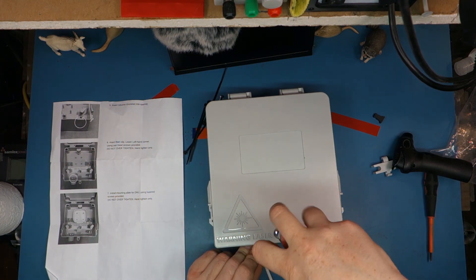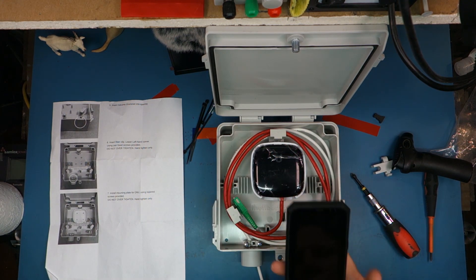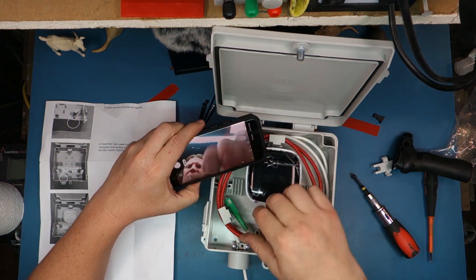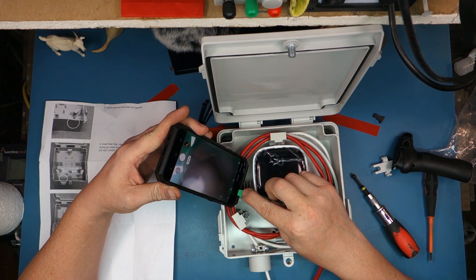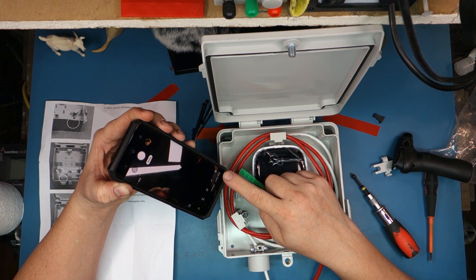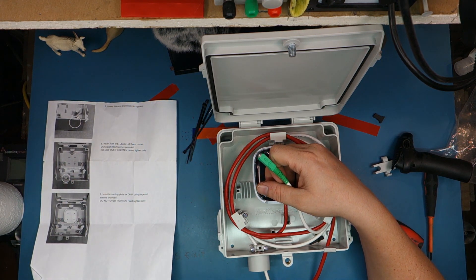We can now open this guy back up. It's got a warning laser label on the front of it, because you don't look into the end of these connectors — if you were to take this thing off and try to look into it for light, you're gonna burn your retinas. But there's a really cool trick: a lot of people don't realize that the cameras on cell phones are actually capable of seeing infrared. They use the infrared on these for retinal detection. So you can actually hold your ferrule up to your camera on your phone and you'll see a little white light in the tip of it — you can verify if there's light if you don't have a light kit with you. That's a cool trick I learned from a Bell technician a long time ago.